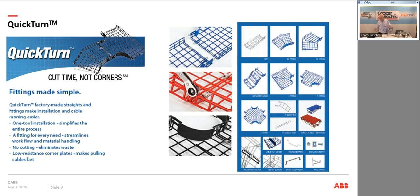A key feature of this product is that because you don't have to cut it, all of the finger joints provide a self-ground for the product. If you use the finger joints, the ground is protected from one end of the installation to the other. Normally the competition doesn't have this continuous ground, so what do they have to do? If you have a 100-foot or 1,000-foot run, you have to order 1,000 feet of ground wire and anywhere from 10 to 100 grounding lugs, and then you have the labor to install it all. So the product possibly could be a little bit more pricey — maybe not.